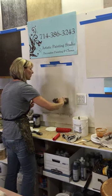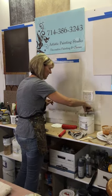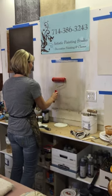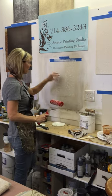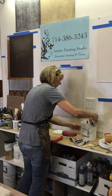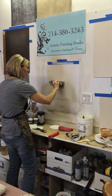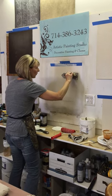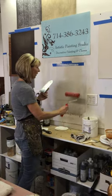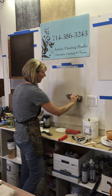So I'm going to trowel this across the whole surface, just going down a couple times to get rid of any trowel marks, and then this is the Ostrich Roller and I'm just going to roll this through a couple of times and create the pattern. Now it stipples it up so you've got some peaks. What I like to do at this point is clean off the trowel so that we have a clean edge to work with, and I'm going to do a really light touch and just knock those peaks down, which creates a lot of dimension and then you don't have to come back and try to sand the area. If you've troweled anywhere more than you wanted to, you can always roll back through and then come back and soften out that area.